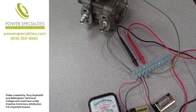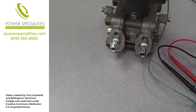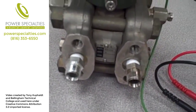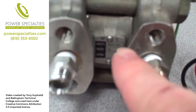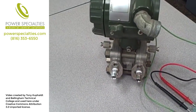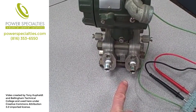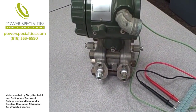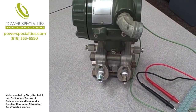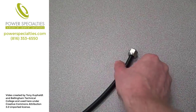The purpose of this demonstration will be to show the difference in function between the high and low pressure ports on the transmitter. If we look at the transmitter itself, down here by the capsule you see two letters, an H and an L. The H stands for high pressure and the L stands for low pressure. This does not necessarily mean the high pressure side will have more physical pressure — it refers to the direction of response that the transmitter signal will take when pressure is applied to either side.